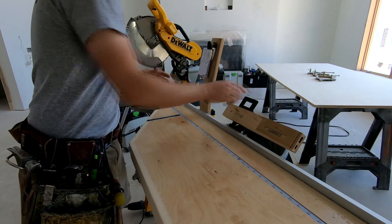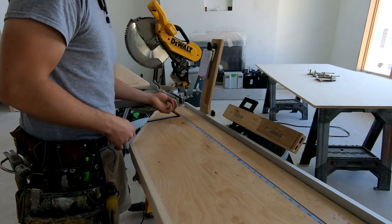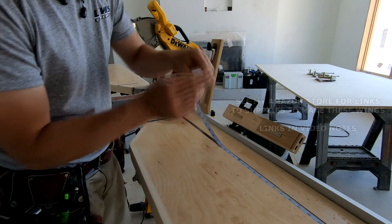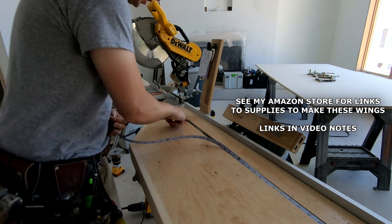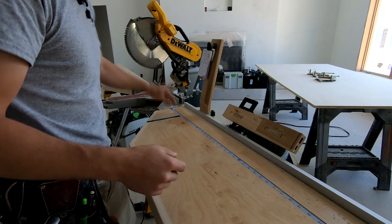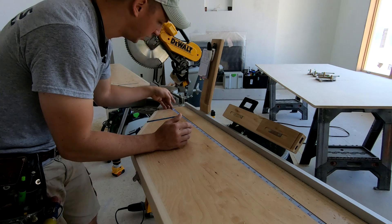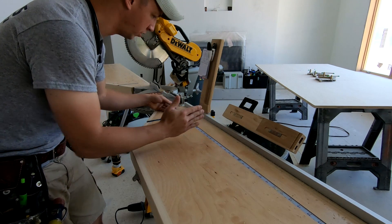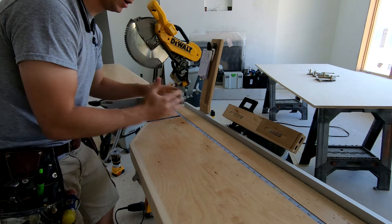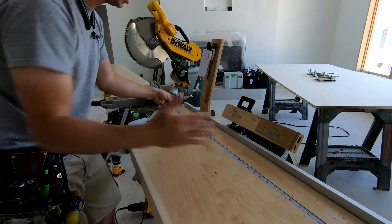The most beautiful thing about these miter saw wings is the stop block and tape configuration. This is your typical peel-and-stick steel tape. Underneath it, I have a dado with some magnetic tape inside, so this tape literally just flops right down and stays inside that dado. The beautiful thing about that is you can calibrate this tape — you can slide it back and forth. So if I put my wings back on and it's not quite in the same position, it's very easy to recalibrate this stop block just by sliding this tape one way or the other.